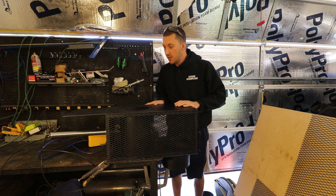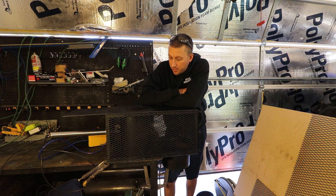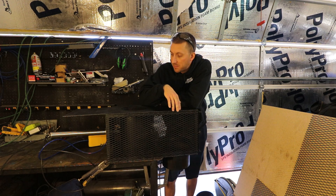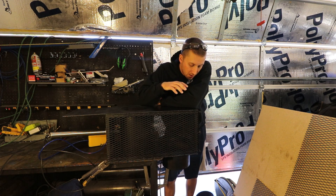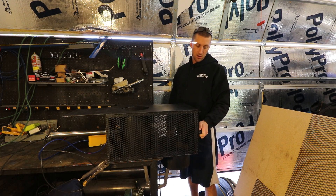This is the first version and I'll have additional versions after this that will be a little different. One thing I learned from building this one: I shouldn't have used expanded steel — I should have just done a plate, because the expanded steel is a pain with all the little tack welds. It looks nice, but you really don't need to see through the sides. The next one will have expanded metal on the front door, but not on the sides.